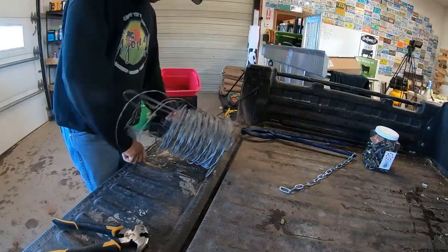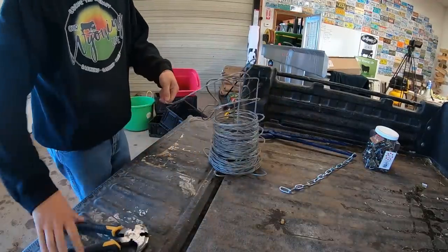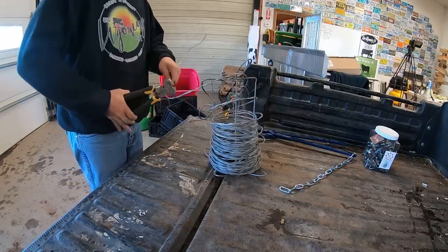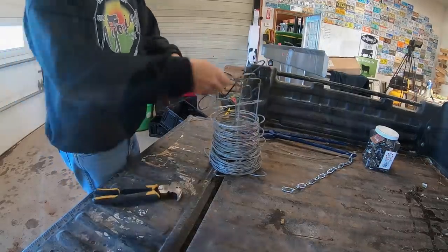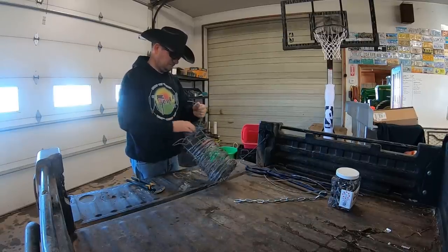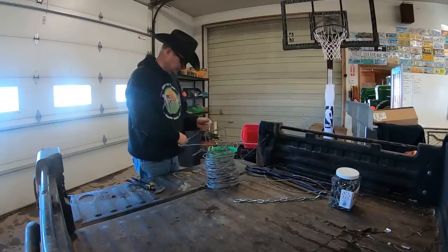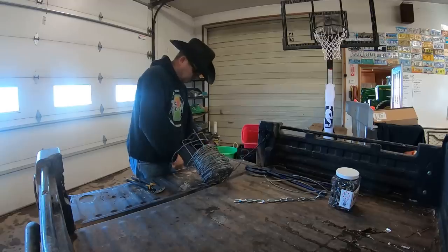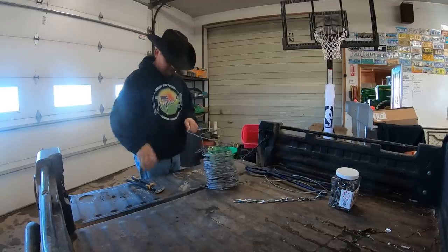All you need to tighten the fence is the tool itself and some scrap wire. I use smooth wire, which I can get for about $75 a roll of about 1,300 feet. I need 18 inches for each repair, and that one roll will do about 800 repairs. Now we're down to a cost of 9 cents for each repair. Roll in the price of the tool and call it 10, and we have enough wire tightening experience for a lifetime, or at least a few years.